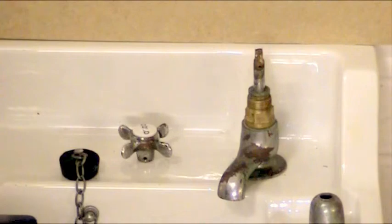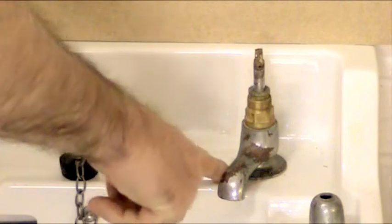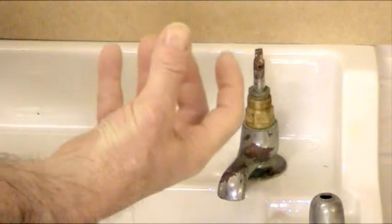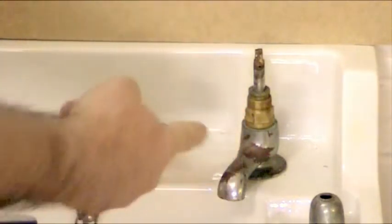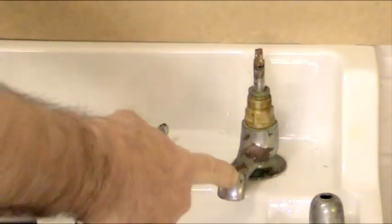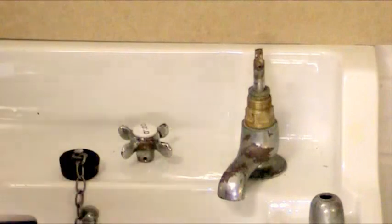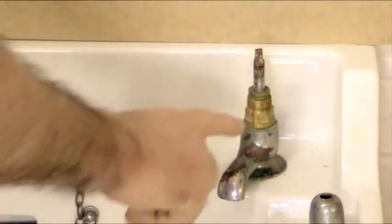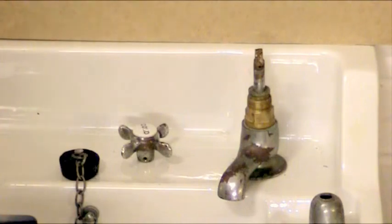So the next — the third stage — is to remove the headgear. This is the particularly difficult problem on these type of sinks because, unlike modern sinks, these taps are set into a square hole, not a round hole, into the sink itself, and they've been set into putty when originally assembled and this putty has now gone rock hard. Any movement of that tap left or right, even a couple of millimetres, will split the sink — and that will be the end of the sink. It can be a disaster. So that's stage one and two in this video, and I will show you in the next video how to safely undo this tap headgear.